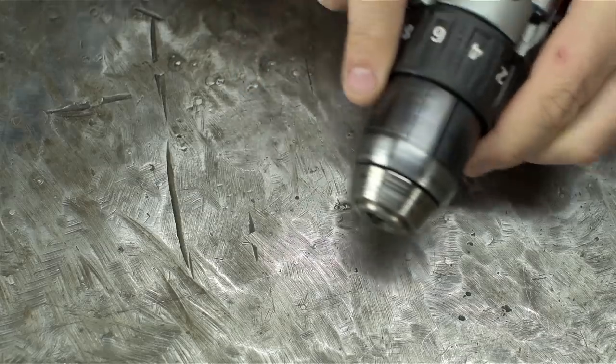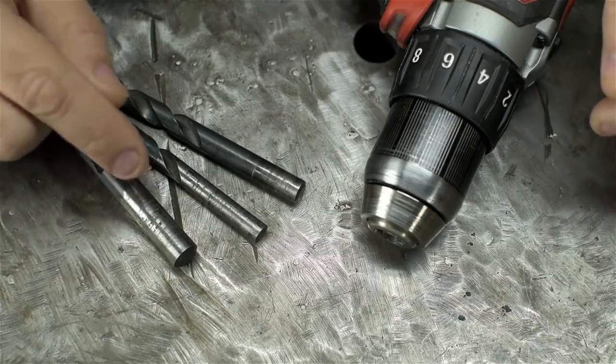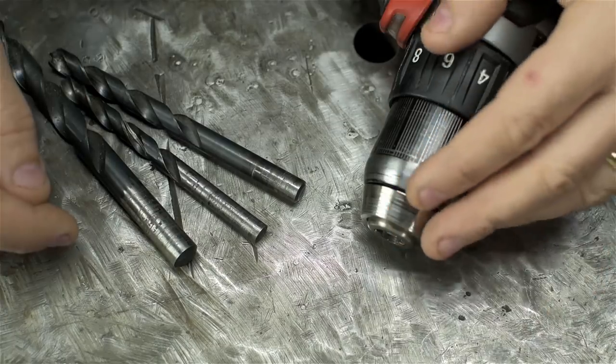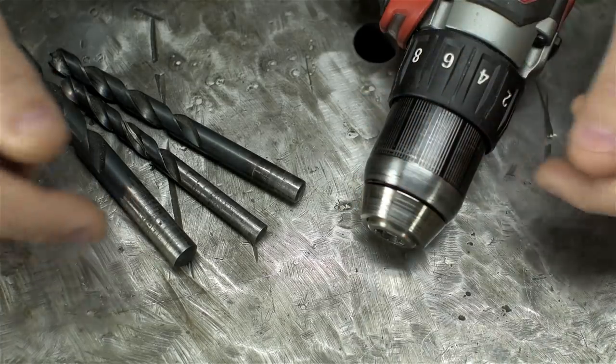Second, maybe this is still first since it's still a chuck issue, it absolutely tears up the shanks on my drills. Chews them to pieces. I can't get the drills back in the index without a lick on the belt grinder. No kidding, this thing roughs the tail ends up so hard, you could take your bit out after drilling the hole, flip it end for end, and use the back of the drill to deburr the hole you just made.